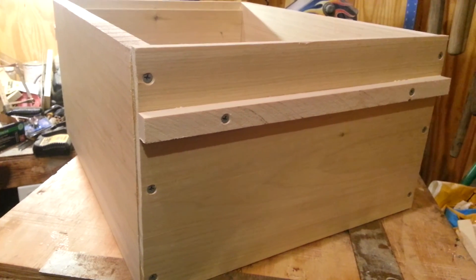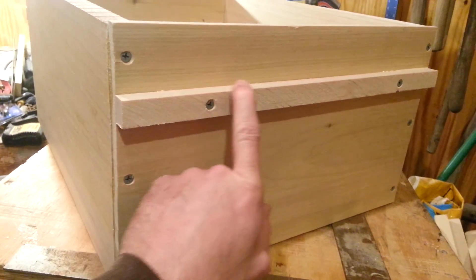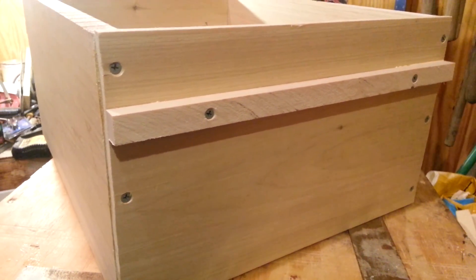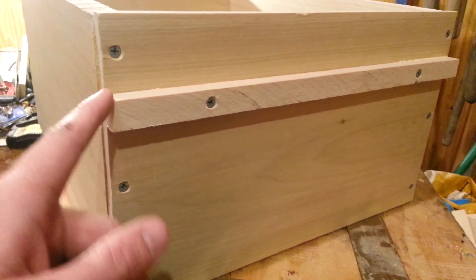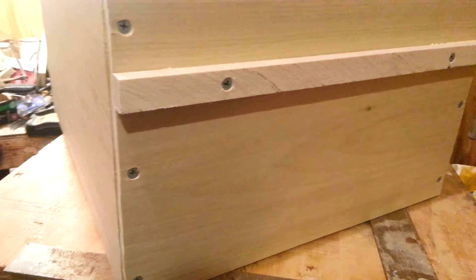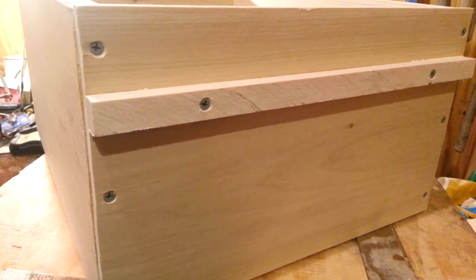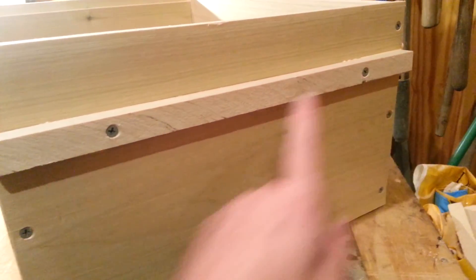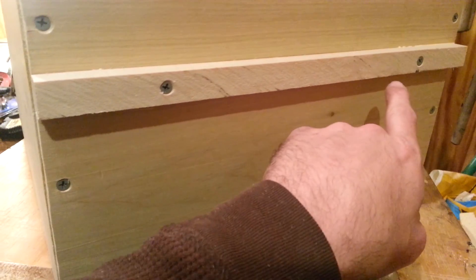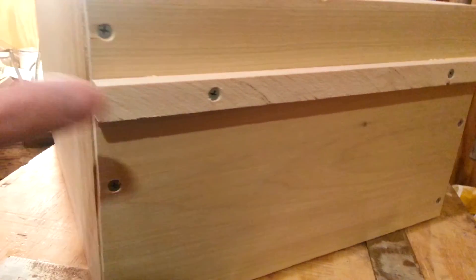While you're ripping the boards down or cutting boards to length, you should end up along the way with a couple pieces of scrap. This is just a piece that is three-quarters of an inch by five-eighths of an inch — a scrap piece that I trimmed off one of the boards — and I just cut it to length: 16 and a quarter, same as the front. Then glued it and put two screws in it. That's what I do for handles. It works great, never had a problem with it.